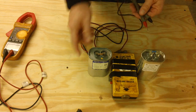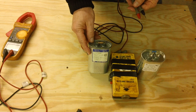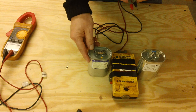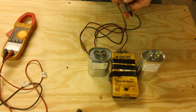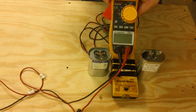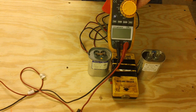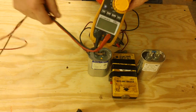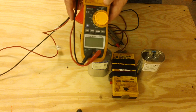This other capacitor is an older, weak capacitor — it was also a 24, but is now at a value of about 20.2. The reason I know that is that I used a digital multimeter with a capacitance function, and it determined that value to be accurate at about 20.2.